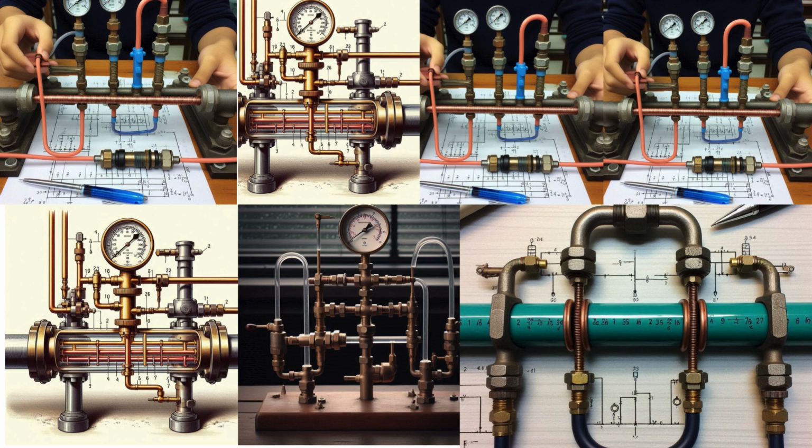Precautions. 1. Make sure that the rubber or plastic leads are properly connected to the petcocks. 2. While taking readings, the petcock lever should be put to the off position simultaneously so that the water columns do not fluctuate and thus remain steady.